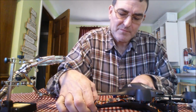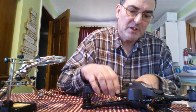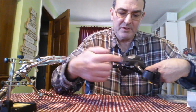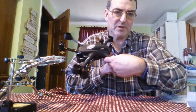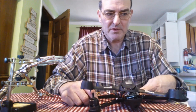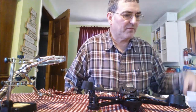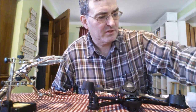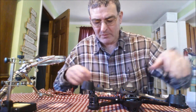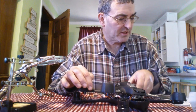I tested it by checking the voltages across the red and black wire of this motor and compared it to the other three which were all working fine. At full throttle, the working motors went from 3.4 volts AC up to 5-point-something volts AC, but the bad one just stayed at 3.4 volts. So I'm going to change what I think is the electronic speed control board.